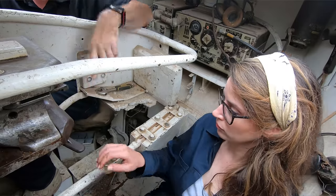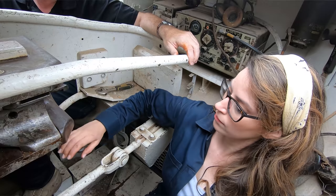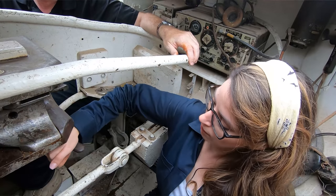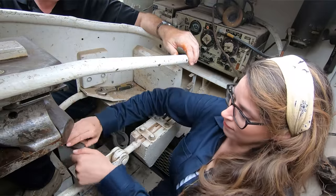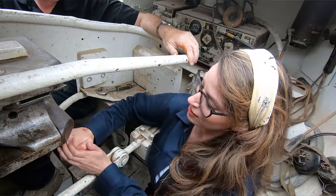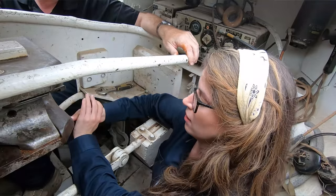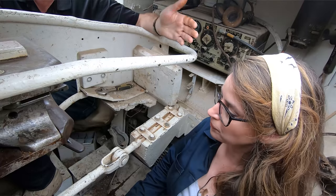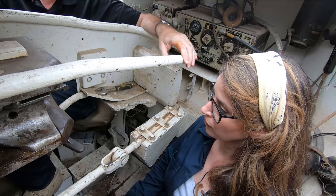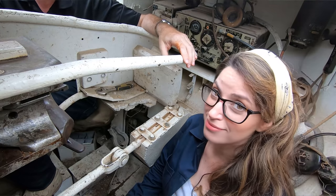So you take your breech operating handle, you open the breech about halfway, pull. There's like a little cushion. Little tab. Yeah. There you go. Hand strength for this. Yeah, there you go. Ooh. Open halfway and let it slam shut. Okay. All right, you've now reseated it, just in case maybe it was misaligned. Fire, fire, recock, fire.